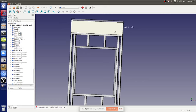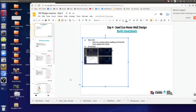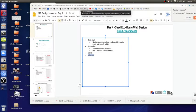Okay, great. No, it's not weaker. It just carries the weight. So normally you've got 4 studs in there? Sure. You still have 4 studs. And then that header is just transferring the load over to your other studs. That's great. That makes sense. Yep.